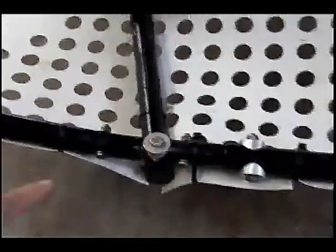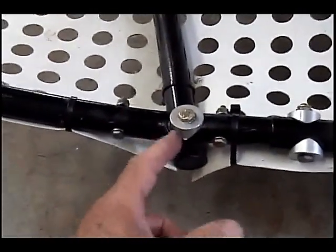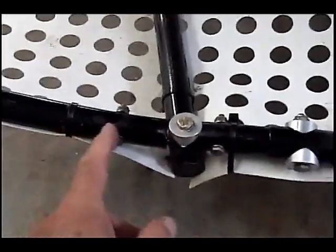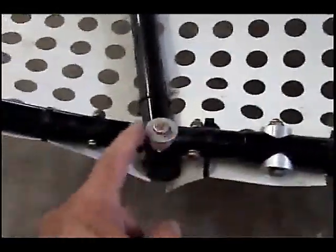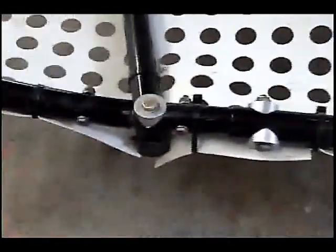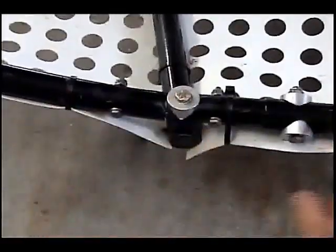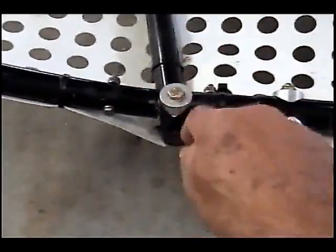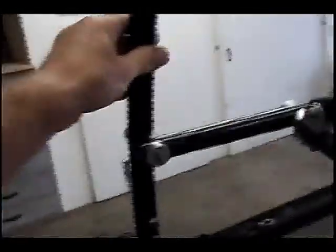At the beginning of our inspection, we found a crack in the tubing of the prop frame — you'll see it on the film. I inserted another pipe within a pipe, so there's an insert pipe inside the outer pipe. I put two bolts through it and bolted it back through the frame, so the prop ring is now pretty sturdy.